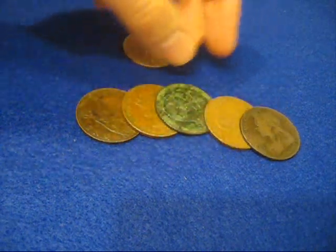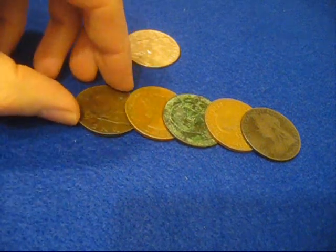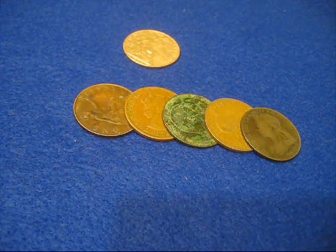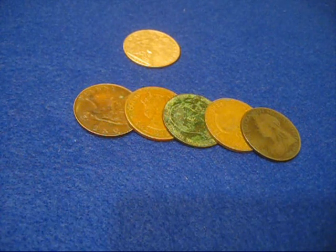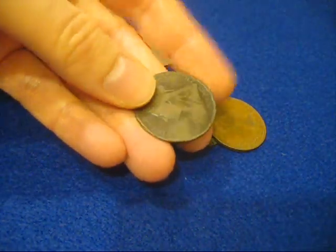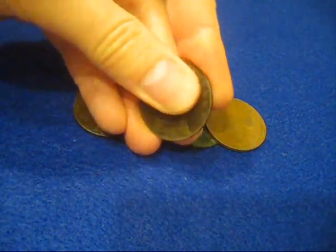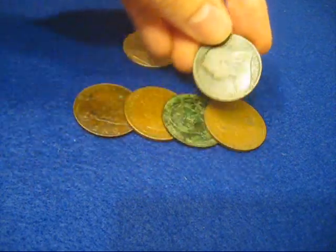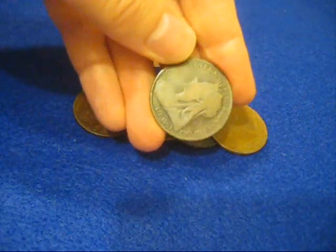It can turn black, it can turn a light brown, it can turn a blue or green color, it can turn almost a reddish color, and of course it can turn a darker brown color as well. There are other colors that copper has been known to turn, like orange and red. It all depends on where the copper is in the world and how the copper is used. This copper was used as coins, so the copper was exposed to oil from people's hands. Part of this oxidization — or as they call it on copper, patina — was caused by people's hands and the oil from people's hands. That patina has incorporated not only copper oxides and sulfides of copper, but it has incorporated hand oils and other environmental dirts and oils.